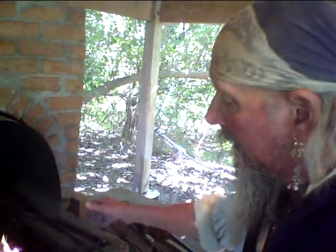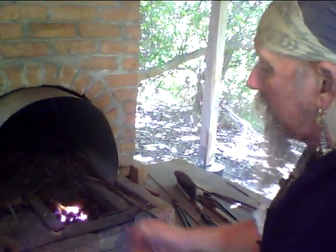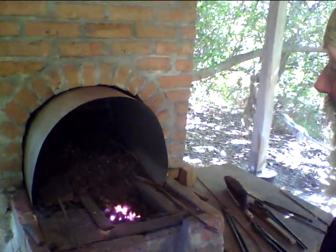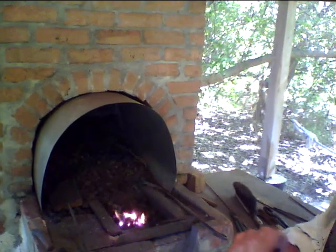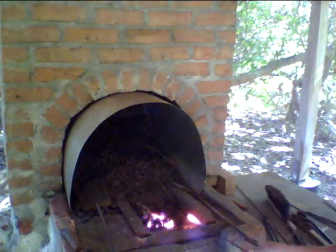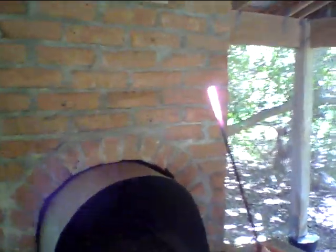The steel I started out with is mild steel. Of course these days — in the 18th century it would have been beautiful iron or steel. Now what I am doing is I take a piece of round rod and I am going to go ahead and heat that up to about 2000 degrees. I need to know what the temperature is, but the only way I can tell is by looking at the color. It starts out black, then goes from black to red to orange to yellow. But if you turn it white it will actually be too hot and it will be a melted mess. Right now this one is a nice bright orange to yellow — about 2000 degrees. Pretty hot.